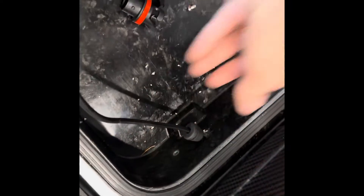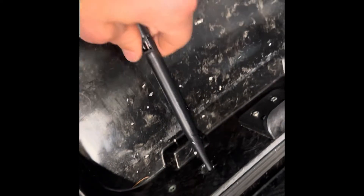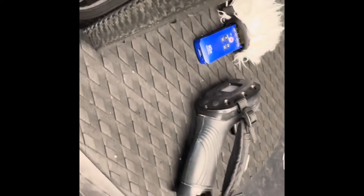I'm going to pull this out. See that water on there? That water means that there's water inside this board — that's what you're looking for. The problem is not the water on the antenna itself; the problem is the water inside of this board.